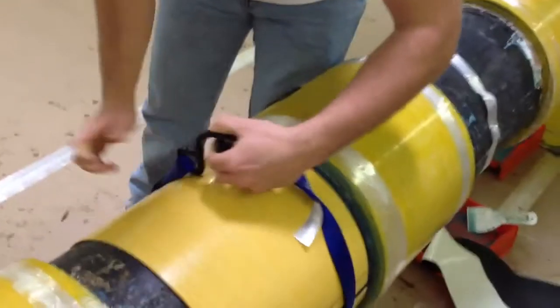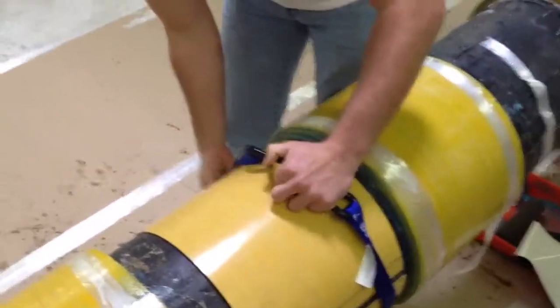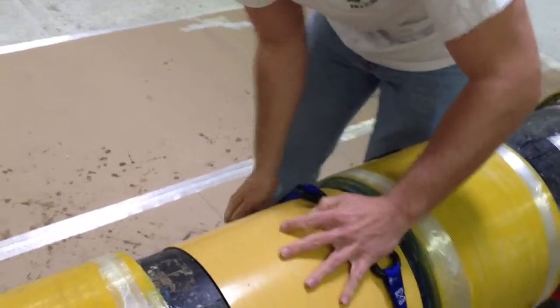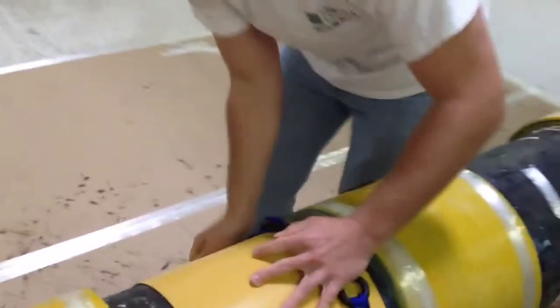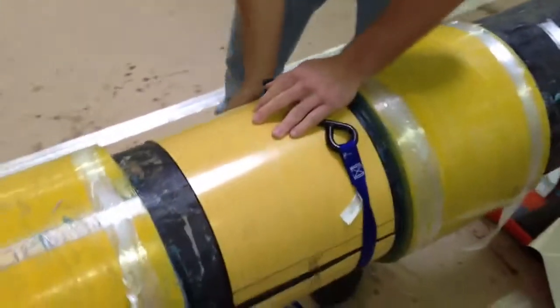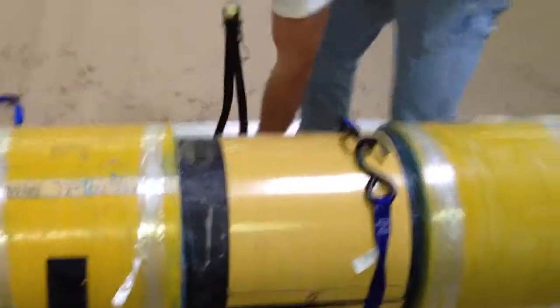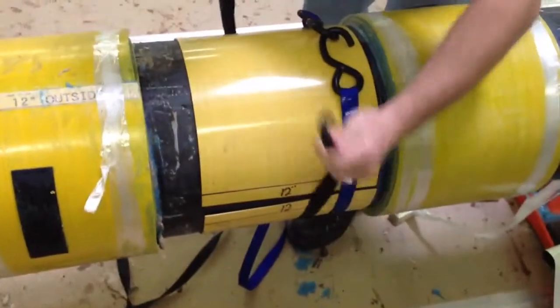In a real-life situation, the inside of this coil would actually have our filler material on the bottom. These ratchet straps will allow us to tighten it down and keep it in place for between an hour and an hour and 20 minutes, allowing it to fully cure out. At that point you would just remove the ratchet straps, leave the single wrap mold on, and install the clock spring coil right over top of it.